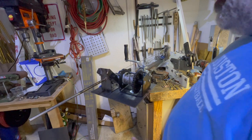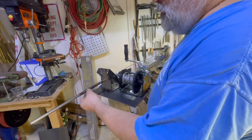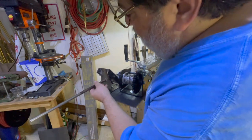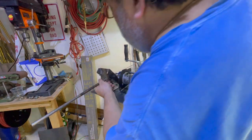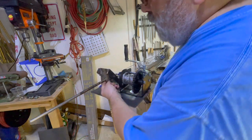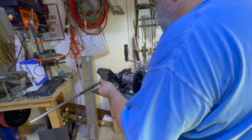This is the setup. I'm going to do a pull on some brass — I'm going to make a lead pipe. I've got my brass, an unannealed brass washer here as the first run. I'm going to get it in the middle and draw it through this plate, through this washer, the mandrel here, and the stock here.